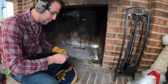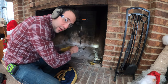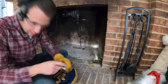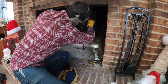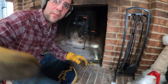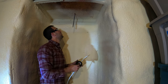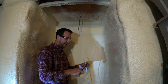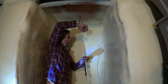So I'm going to start drilling and I'm going to use a little nail polish here to mark the bit so I have a gauge of where I'm at — that'll let me know how far I went down. Don't tell my daughter I stole her nail polish. So I took it down to the basement to see if the drill bit was popping out. As you can see, we got through it. These Bosch blades are amazing — I just went through about 10 inches of concrete in probably two minutes, not even, and I was barely holding on to it. It was just letting the drill do everything.